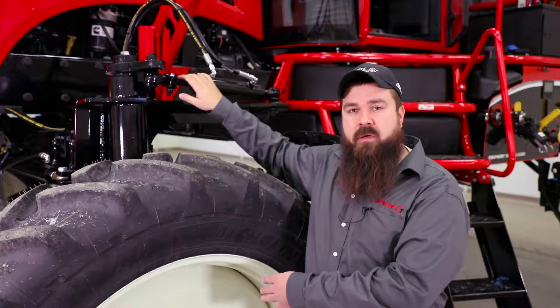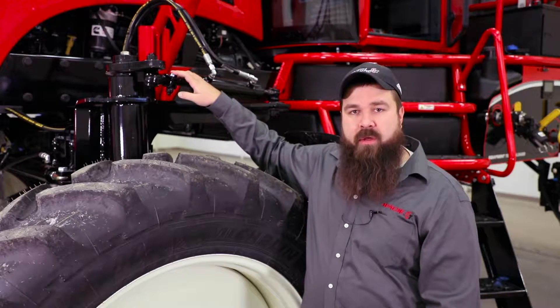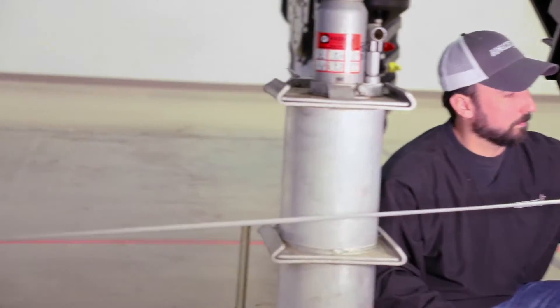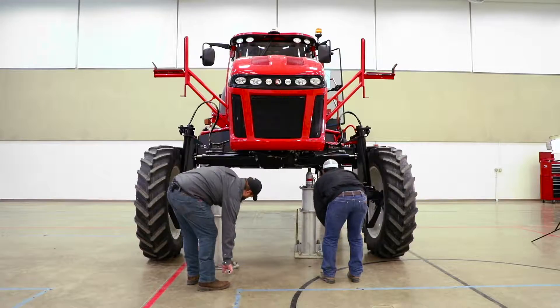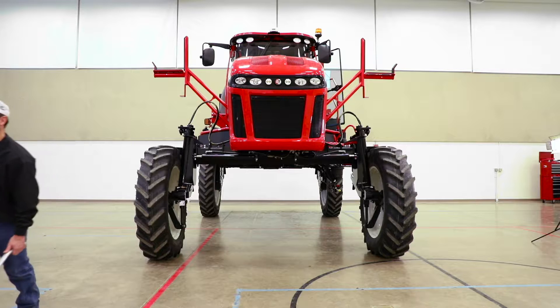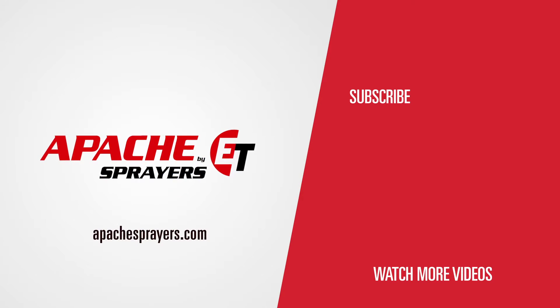Once you have adjusted it, re-measure. Once you get your eighth inch plus or minus a sixteenth, come back and make sure you tighten your clamp up on your tie rod end. Once you have done the left side, go to the other side and do the same for the right side. Thanks for watching today. If you have any questions, make sure to check your operator's manual or contact your local servicing dealer.